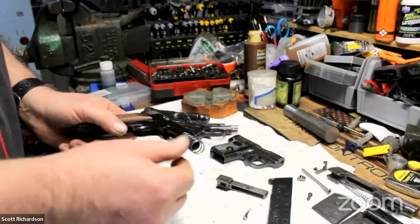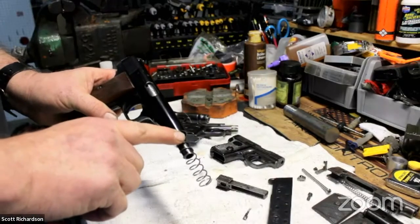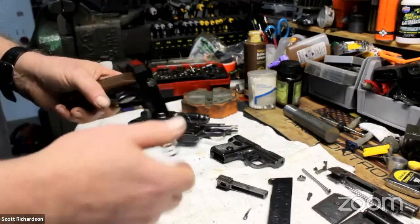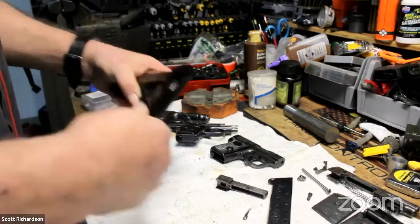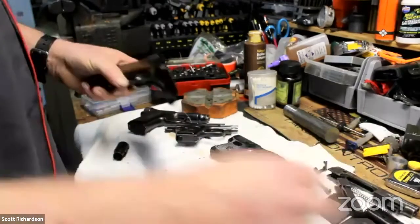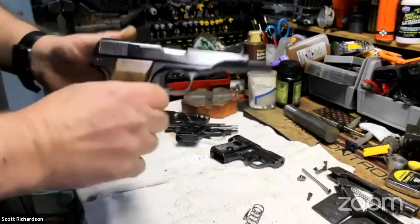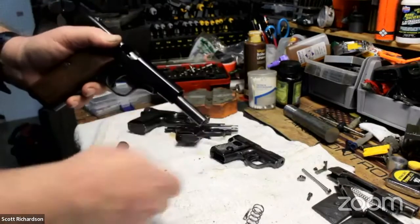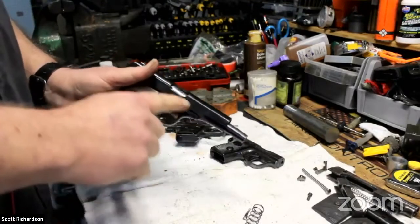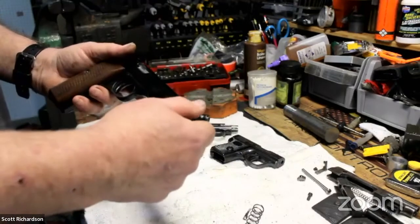The recoil spring just goes around the barrel — another clue it's a Browning design. The more you work on similar guns, you start to pick up the design cues as to how to disassemble them. This just slides right off, exactly like the MAB works. Now the spring is off but the slide isn't going anywhere. So I started trying to rotate the barrel, which is how a lot of these Browning designs come apart, but I couldn't find the sweet spot where the cuts in the frame lined up with the risers on the barrel.